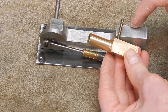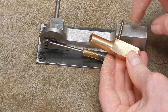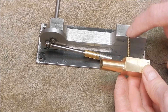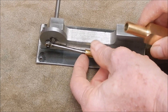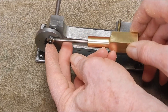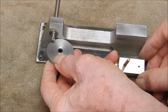I've machined up the wobbler block here. I've got to drill this through and put a brass pivot sleeve on it so the screw doesn't rub the aluminium. I'll sleeve this and sleeve the body as well, so it'll be brass on brass — because you get quite a bit of wear here. If you try to run a shaft through plain aluminium it'll get sloppy pretty quick. This has all been reamed, and that's going to be the mechanism.